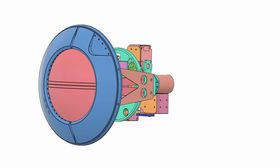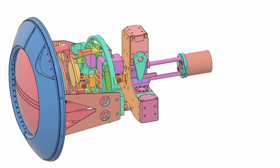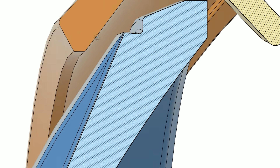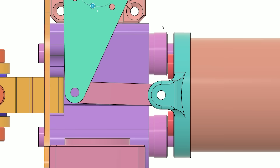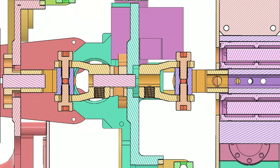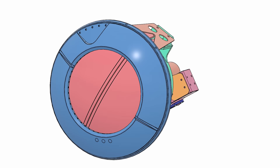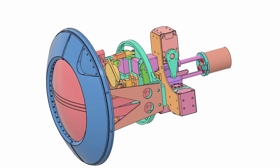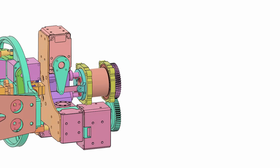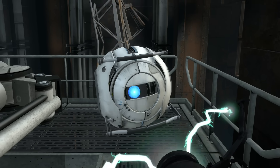A push rod connects to a swivel aligned with the universal joint, and the servos are mounted on a plate toward the rear. To add the pop-in/out ability, I designed the whole eye and face assembly to rest on two linear bearings that ride on 6mm shafts fitting into a larger rotating component. The third servo drives the entire eye and face assembly in and out — at max extension his face just barely clears the inner shells, and when fully retracted he pulls in 6 millimeters. It was really tight to cram this mechanism inside, because the thickness of all the motors and components limits how much I can retract.